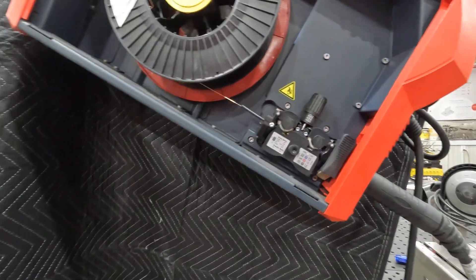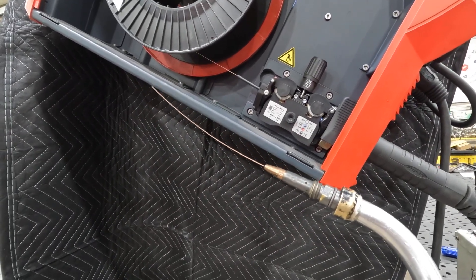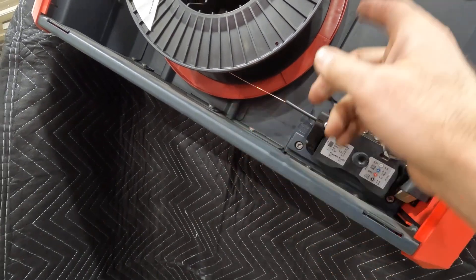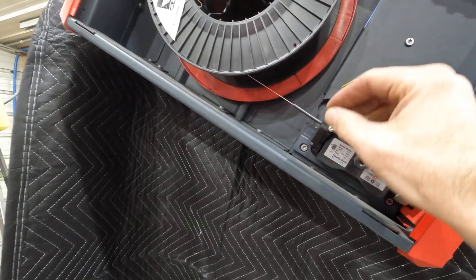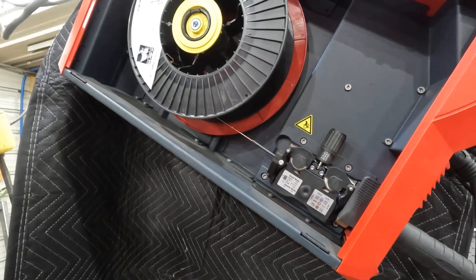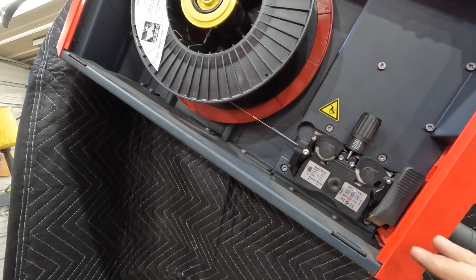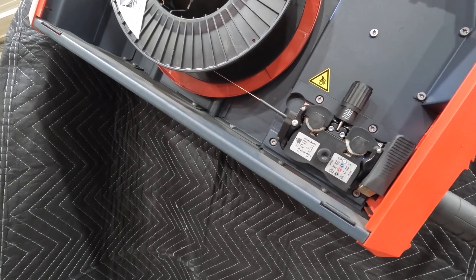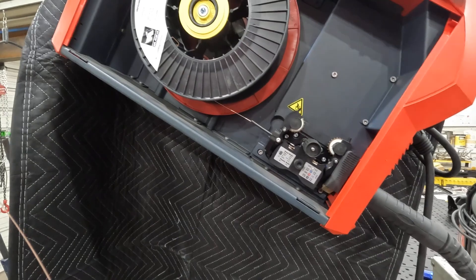When diagnosing, grab the machine, flip the cover open, and bump the trigger. Watch the tension coming off the brake — you want a little bit of slack so it's not fiddle-string tight, but you don't want it to unspool and birds-nest wire inside. If your brake is acting properly and consumables seem fine, the best way to start diagnosing is to manually override something — disconnect all your drives and check the brake first.